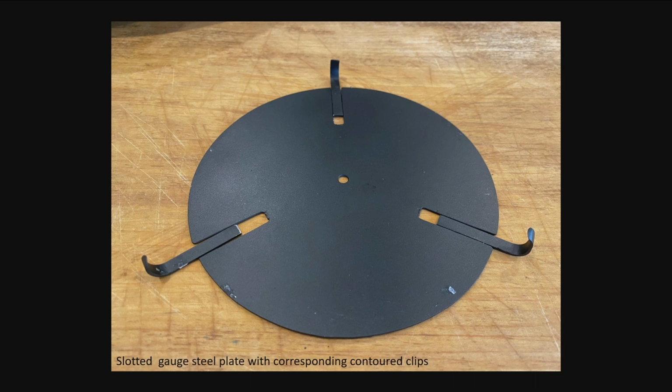Now you look at this and you say, okay, what's the big deal? Well, when we're talking about an installation or a deinstallation, the big deal to me is right here. Before, whether it's 3 clips or 2 clips and a contour and an interface, you're talking about 4 holes on the top of a deck. 1 internal, 3 external. Here you're talking about a single point of connection, okay? That single point of connection means you have less coordination between points, so less probability of mistakes. But also, if you mistake drilling out here and you have to move, or let's say a curator changes their mind as to where they want something, you have a big problem in terms of patching your deck if you're drilling through. Something like this, if you're still within the footprint of the object, much easier to adjust and simply move the object.